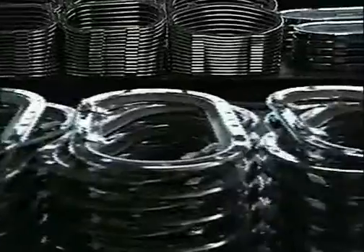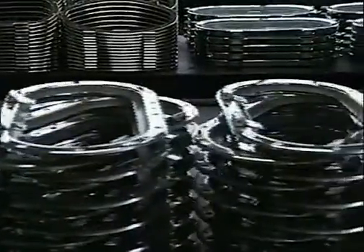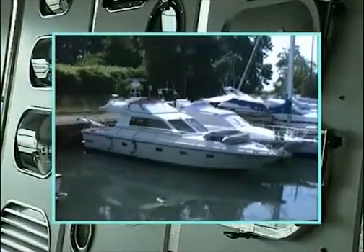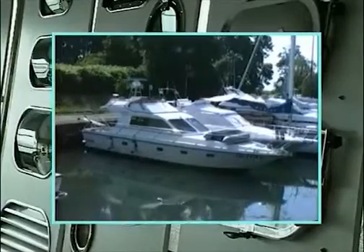The keys to success are using the right stainless steel, good design and competent fabrication. These portholes will operate in a severe marine environment, but the fabricator's skill and the designer's choice of an austenitic stainless steel containing molybdenum ensures that their performance matches that of the boat.